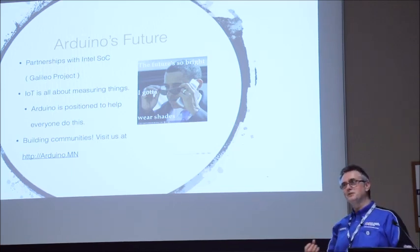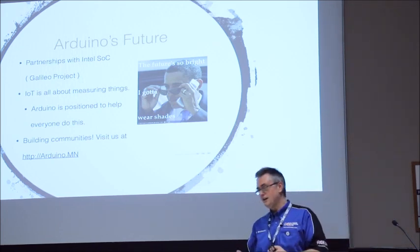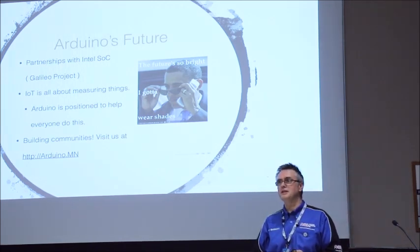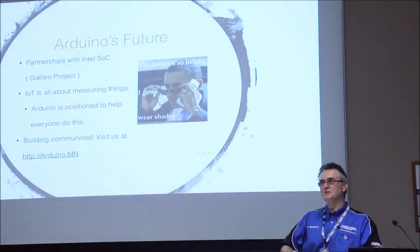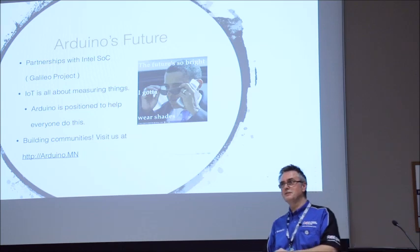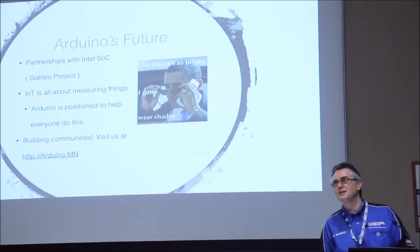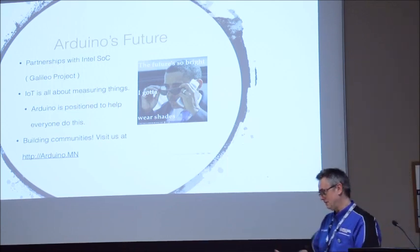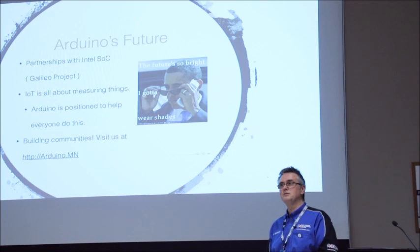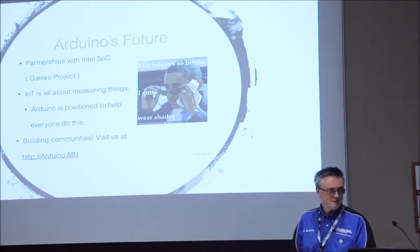I've got this Mega at the moment and, when they did the instructions list, you have to wire the RX to the RX and the TX to the TX for it to actually work. Whereas on all the other ones, it works with TX to RX and RX to TX, so I'm quite sure it's some dodgy clone and I thought this isn't quite right. I need to read all the instructions, so that those people are not unable to get these damn things working, because I've got some cheap Chinese knockoffs. Apologies for that, folks.